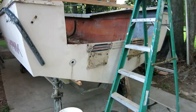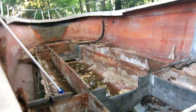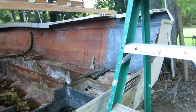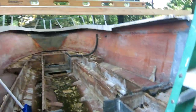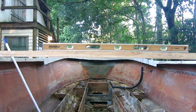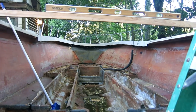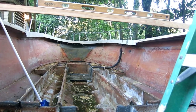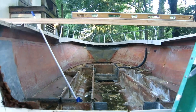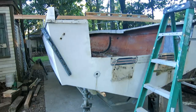I've got the boat where I want it and it's on the dolly, but it's really flexible and that's not going to work when I'm doing fiberglass work — it needs to be stiff. It's also not level, so I'm going to put some blocks under the dolly, get the front up a little bit to drain some of this water, level it side to side, and put plenty of struts so the hull doesn't bounce when I start doing glass work.